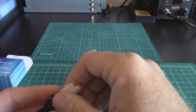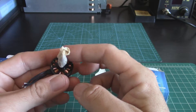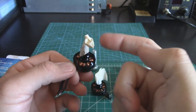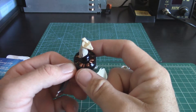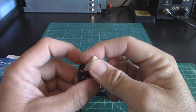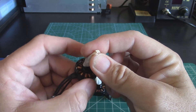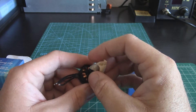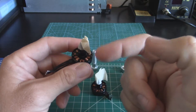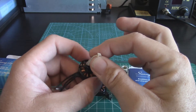Here on the standard motor, spinning to the left it comes off, spinning to the right it tightens up. So if the nut is spinning clockwise while the base is held still, that tightens it. The opposite is also true: if you hold the nut still and spin the bell counterclockwise, the nut is tightening. Holding the nut still and spinning the bell counterclockwise — that is tightening it.